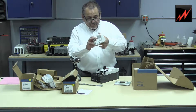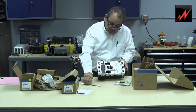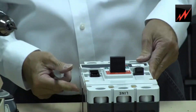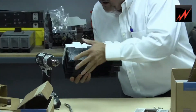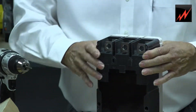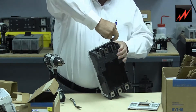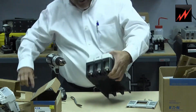So now we're at a point where we're going to get the trip, terminals facing the outside of the breaker. We're going to slip it in and sneak it in this way. There's a little red knob that sticks out — we need to depress that with this little spatula tool that we use as a shoehorn here. We're going to depress it, then slide the unit in, and it's seated. That simple. It's just pressed into position. As you can see the edges of the frame, you know that the trip is near its seated point. Now, what we're going to do is get the hex bit and go underneath the terminals and tighten hand-tight until it's pretty firm, each phase. I'll just do the center one to demonstrate.